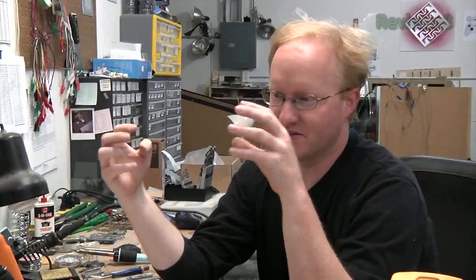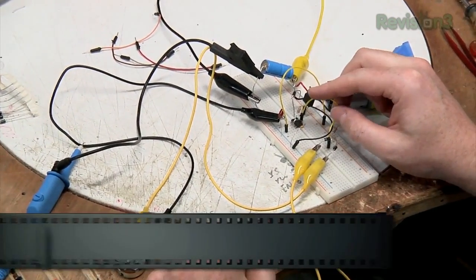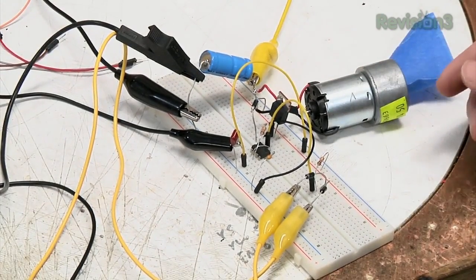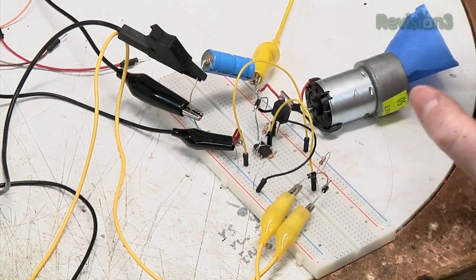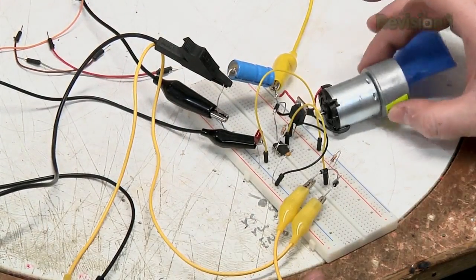One of the camping projects I'm making is a solar-powered rotisserie — where you stick your food on a spit and it rotates around the fire so you don't even have to flip it. That way you can go off and fish or drink a beer. We just use the solar cells to power the motor, but we want to control the speed. I've made this circuit whose core is a 555 timer — a very versatile integrated circuit used in all sorts of stuff — and it controls the motor using pulse width modulation. If you just apply 12 volts and ground to the motor it will rotate at full speed, and this motor has a gearbox for more torque, but it still rotates a lot faster than we want. So we're going to send it pulses — a pulse of voltage, then low, then another pulse — and the length of the pulses and the time between them dictates how fast the motor rotates.